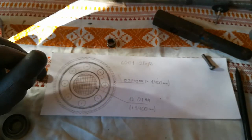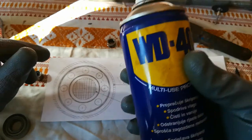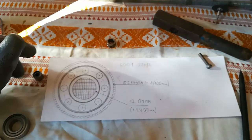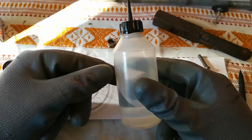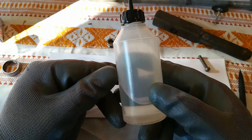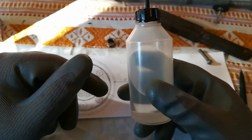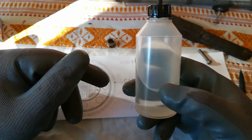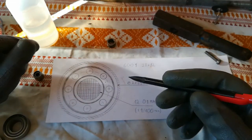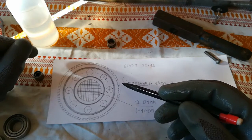Now let's talk about less invasive methods that might work. Of course, you can use WD-40 — it's a beloved liquid for almost everything — but there is also one trick. This here is baby oil. Any kind of baby oil will work. The viscosity of baby oil is very thin, so it's used as a penetrative oil if you don't have WD-40. When you heat up the hole around the bearing, it's going to even more reduce the viscosity — it will become more liquid, so it will penetrate and lubricate even better.